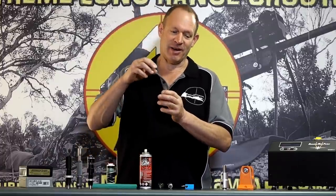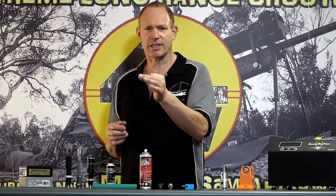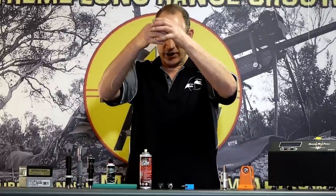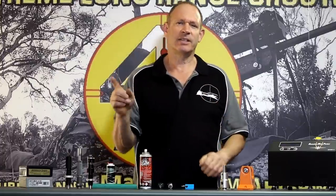And I suppose that's one of the things that a lot of people may get a little bit wrong, and that is when you have a competition neck sizing die that has both the expandable and the neck sizing dies, the collets inside there, replaceable sleeves, that system isn't really designed to work together. Although you can get a little bit of the crush on the outside and the expandable on the inside, when you pull that expandable back out is where the size that you really end up with is determined.